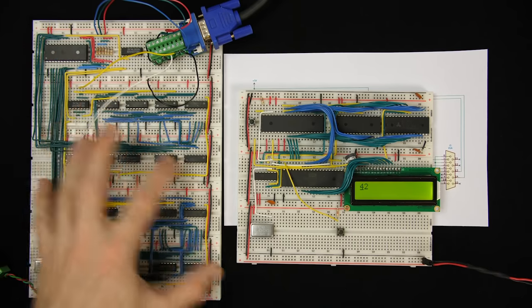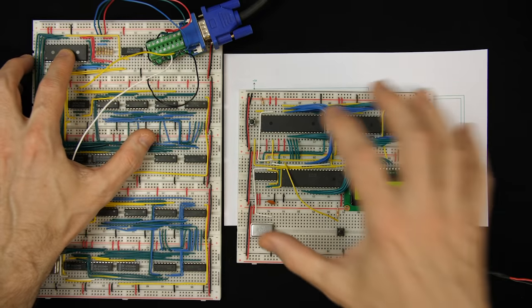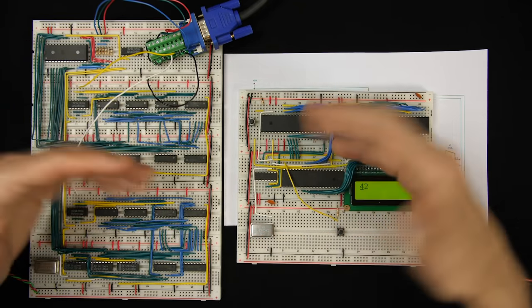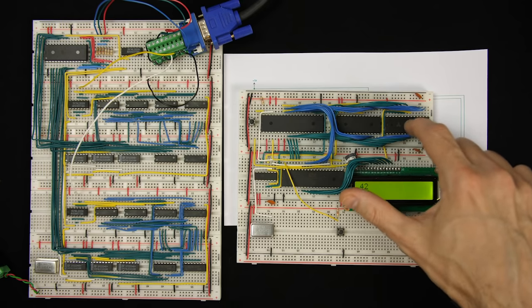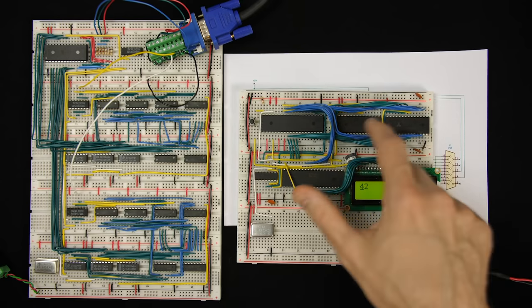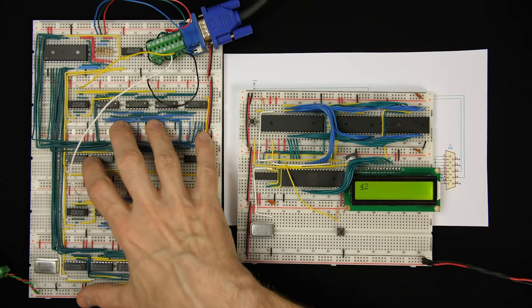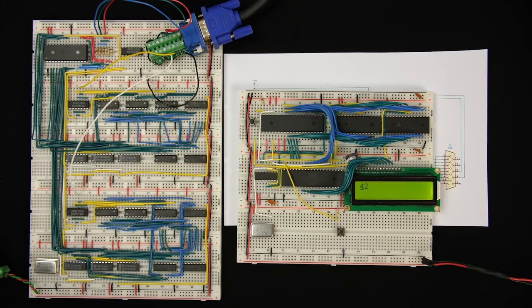The trick is that the video circuitry needs to be able to read from the RAM and output the right pixels, and the CPU needs to be able to write to the RAM to update what's being displayed — and those two things need to happen without any conflicts. We already have 16K of RAM in our computer and the CPU can read and write from it just fine, but we need a way to also allow the video circuitry to read from the RAM at sort of the same time. That turns out to be kind of tricky.